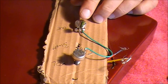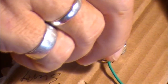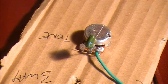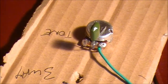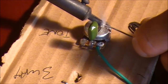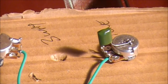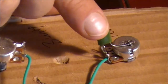So we want to solder this long leg to the top of the pot. Before I do that, I might actually cut this leg a little bit — it's just a little bit too long. So I'll grab my pliers, bend that wire up, and cut about a third off that long leg. Now bend that capacitor down so it's touching the top of the pot where I've scratched it. We just need to drop a blob of solder on there to make sure that's earthed. And there you go — that's earthed to the top of the tone control, so that is now a tone pot. We can just bend that capacitor down to get it out of the way.